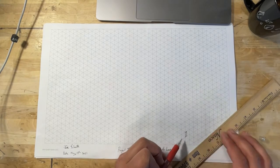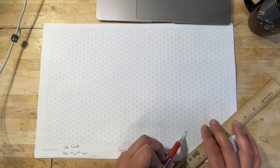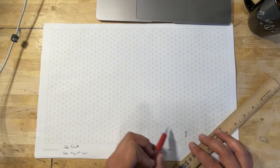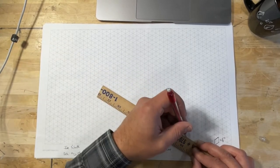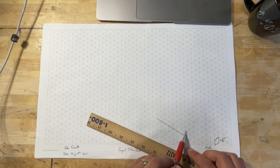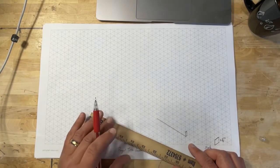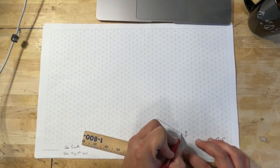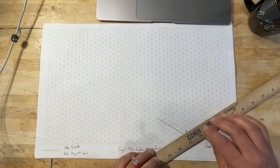Now, spacing wise, remember that our decking is going to be 36 inches wide total. So we're going to space this 2 feet on center, and we're going to start this first board 6 inches in. This board is going to run this direction, so it might help if I run a line up this way a little ways. We'll always see this bottom edge, I believe. That's my board there. These deck boards are going to extend past 6 inches. So what does that look like? 6 inches past this edge, the deck board will start right here. It's actually going to share this edge back. Let me draw a deck board in that is 3 feet wide.